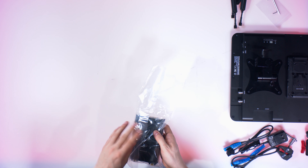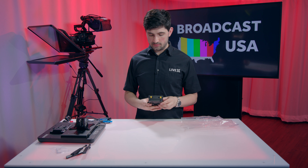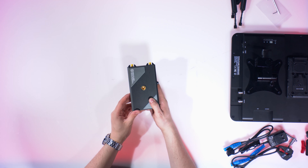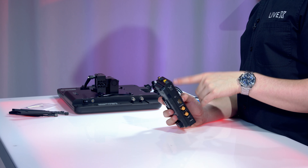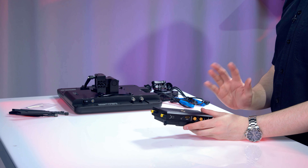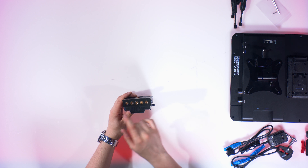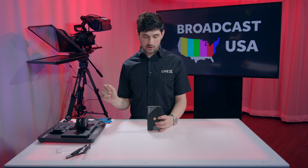That's how you're going to transmit that 3G 1080p60 video signal. Let's open up the transmitter. This thing is pretty large — probably the biggest wireless transmitter I've seen — and it is a little heavy, so you definitely have to make sure you secure it to your camera, especially if you're handheld, and make sure it's in an optimal location. There are two antenna ports where you screw in the antennas. It comes with three but looks like you only need two, so it gives you a backup. You have two ways to mount it: a 3/8 screw on the front face or 1/4-20 screws on the bottom. I really like how you have a lot of options — as a camera operator, everything is very specific, so I like how you can position it exactly where you want.